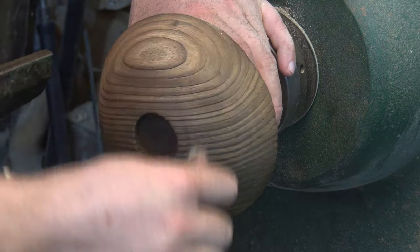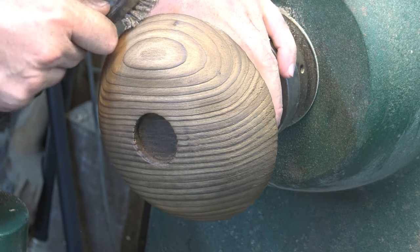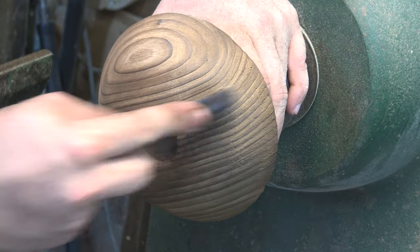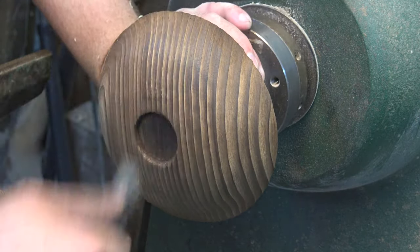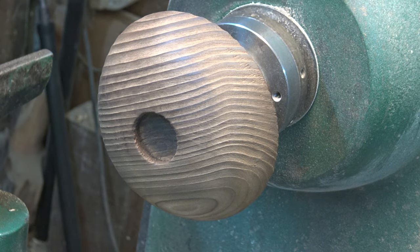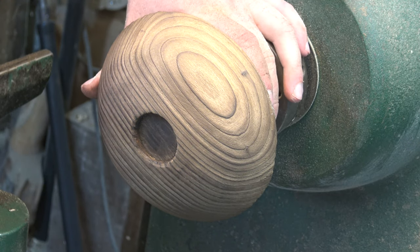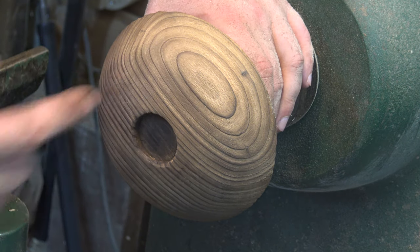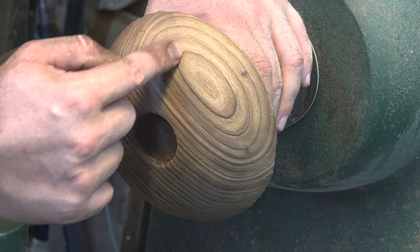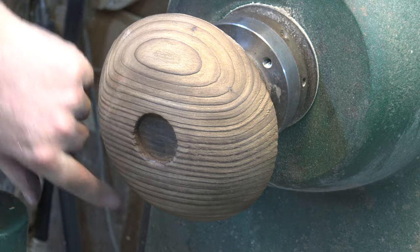We want to take those scratches away. What this wire brush is doing is opening up the pores — we're going to be using a wood dye in a second, and opening up those end grain pores is going to help the dye really soak in and bring this piece to life. It's a lovely textured piece. The tree has two types of growth: early and late, or summer and winter. The winter growth tends to be a little bit hardier because there's less sunlight for photosynthesis, so they stay there more than the wider summer growth. And that's how we're getting these different ripple patterns.